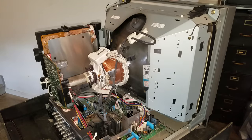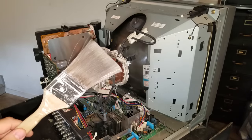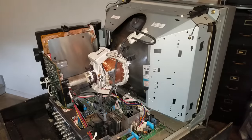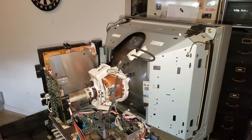I've found there are two great things to really get rid of dust in your monitor. The first is a very high quality non-conductive paintbrush — this one's very clean. I just like to brush over most of the PVM starting from the top down. That way I can free up a lot of that dust, and then I'll go back after that and hit it up with some good old-fashioned compressed air. Let's go ahead and I'll let you watch me clean this PVM and get a lot of this dust out.